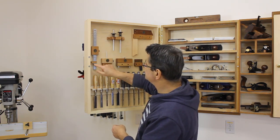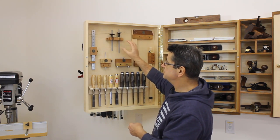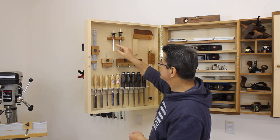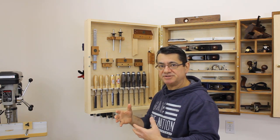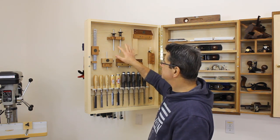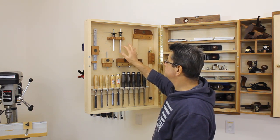This is a custom holder, and this little cherry part keeps it from bouncing and rattling. Next are two marking gauges I use most often — primarily for dovetail joinery. This more precise one can be micro-adjusted. The reason I have two is that when working with half-blind dovetails you have to readjust the marking gauge for either transferring pins or working with tails, and you lose precision doing that. So I use two, pre-set for offsets from the half-blind to the edge of the board.